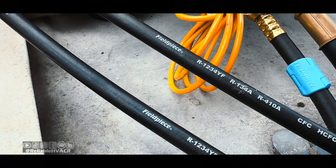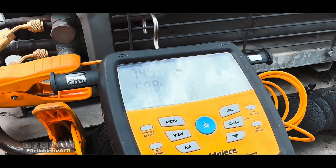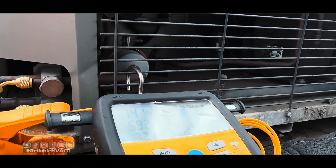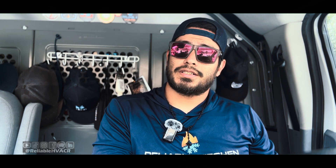So it's technically working — we have 40 degrees and dropping. I had to add a little bit of refrigerant. Technically the EEV got recommended and one of our guys was going to change it out. I came and he mentioned that the sensor looked almost burnt.